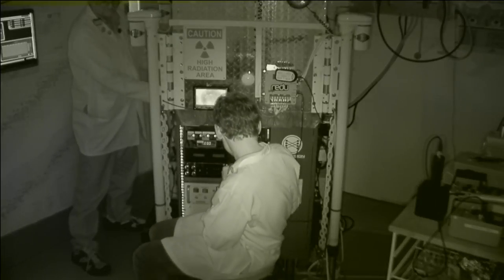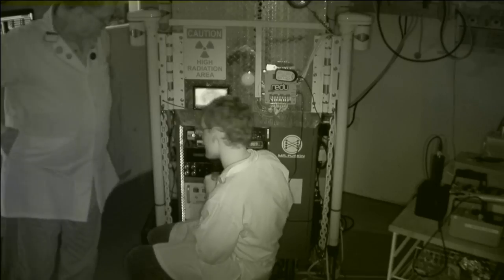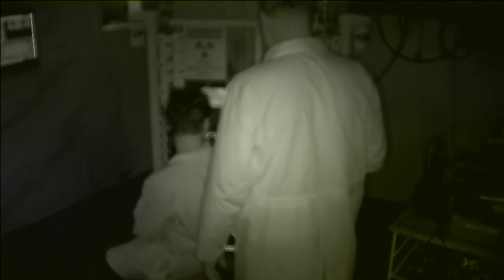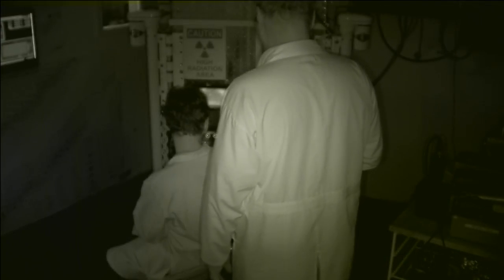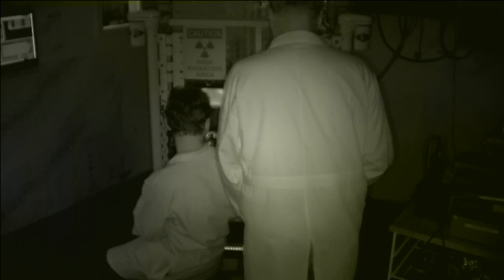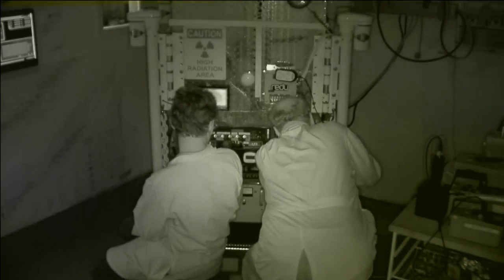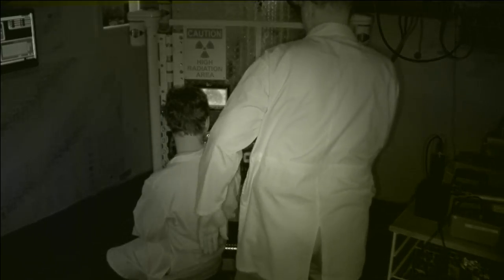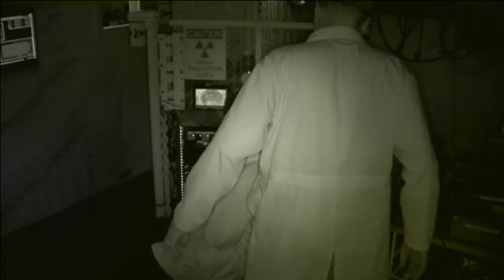Okay, so we're on the number two. Number two MFC enable, go ahead and set gas flow to 2.5-ish for now? 2.5, yeah, we'll just watch. Yeah, I got that set already. Okay. So, Poiser at 0.2. What did you get this thing at? 70,000. We're going to go ahead and drop voltage, leave it in constant current.